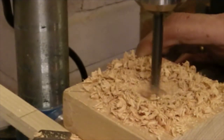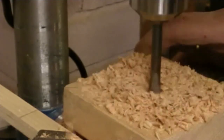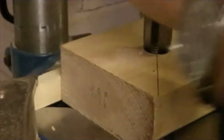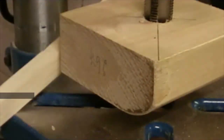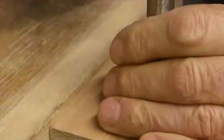I'm going to use a block of beech and I'm going to drill a 17mm hole through it and then I'm going to start the threads off on the drill press to keep everything square. Once the threads are started I'm going to have to finish off by hand because it gets quite hard to do.